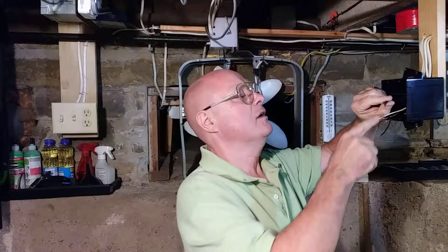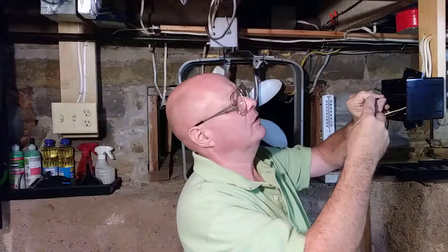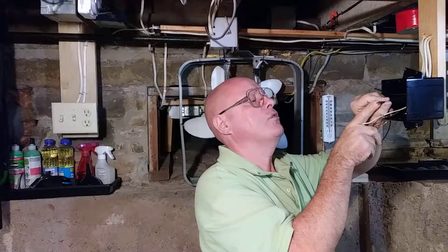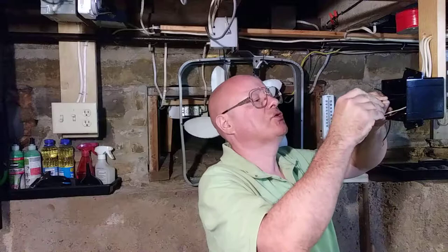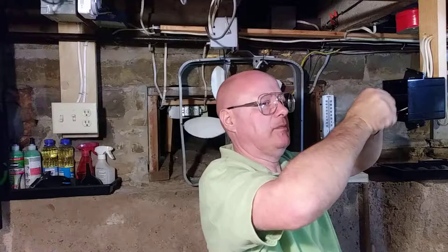Okay, so I look, this insulation came down a little bit. Okay, they're even at the top, but okay, they are pretty even. The one just went down a little bit, but it's not that much. So I'm even at the end here with the 3 coppers, and the insulation is about a 1/16 of an inch, so that's okay. And we'll put them into the box.